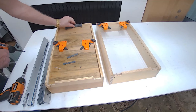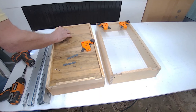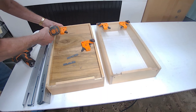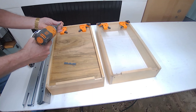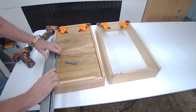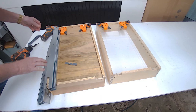For the pilot drill on half-inch material, use the same template — slide it in and pilot drill. I'll show you what happens if you mount the bracket without the shim: it doesn't latch in, it's only partially in. But if you use the spacer shim, it locks into position properly.